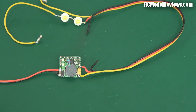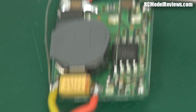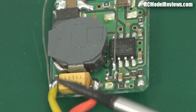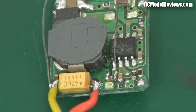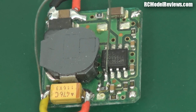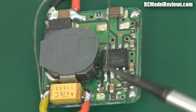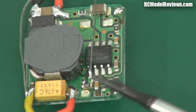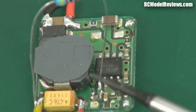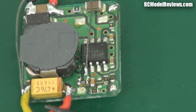I'll do a close-up zoom so you can see exactly what I've done. Here's the board — you can see there's a resistor I've added up here at the top. I've run it from this pin of the chip over to the ground (negative). What I'm doing is effectively putting this resistor in parallel with a much smaller one down here, because these are the resistors the board uses to set its regulating voltage. This pin needs to see a specific voltage, and the circuit will hold its output at whatever voltage maintains that specified input on this pin. By changing the resistor values, you change the output voltage. I've put another resistor across one of those in the divider — the one that divides the voltage down to ground — which pulls the voltage down a little, meaning the output voltage has to rise to compensate.